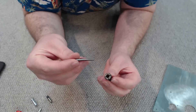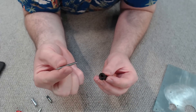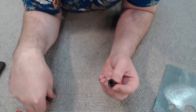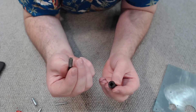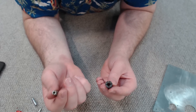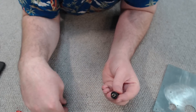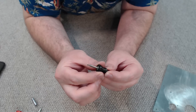Let's say you want to use a Dremel engraving bit. In round figures, this is 3.2 millimetres, and the collet is quarter inch, so obviously these two aren't going to work too happily together. That's where this collet adapter comes in. This has actually worked out rather well for me — I haven't had any problems with wobble or anything like that. There'll be a link in the video's description to purchase it off eBay. It goes from quarter inch down to 3.2 millimetres, and then you can run your Dremel bits.